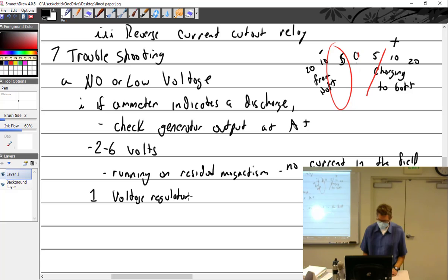That's very good. Survey says, number 1 answer. Could be current limiter? No. It can't be the current limiter. Current limiters don't really break to where they work better. It would be open and then it wouldn't have any effect. So I wouldn't say that because they're normally closed anyway. Depending on if it's an A or B type, the field coil could be grounding or something like that. Okay, field coil. Field coil could be open.